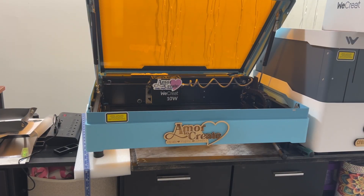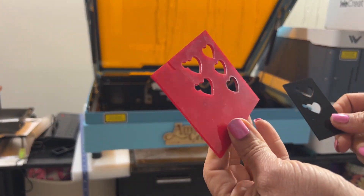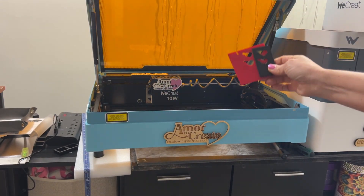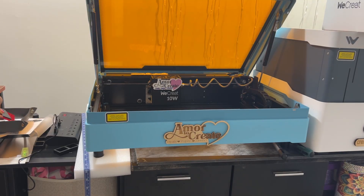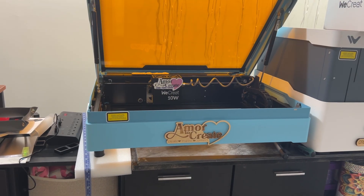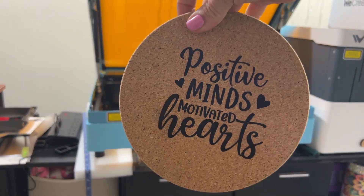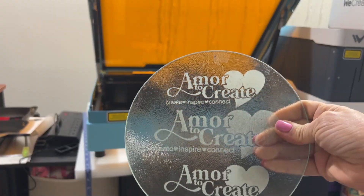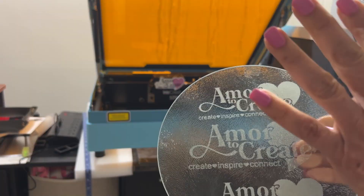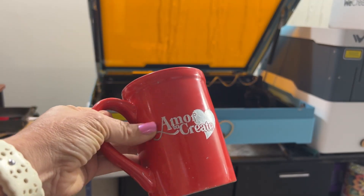As with any other diode laser, it has its limitations when cutting acrylic. You can cut black or red acrylic, but I don't recommend a diode laser if you really want to cut all colors of acrylic, because you won't be able to cut some colors like transparents or mirror acrylic. You are able to cut and engrave wood, engrave items like cork, and engrave glass — though to engrave glass, you'll need some kind of medium for the diode or blue laser to see the glass. As with other lasers, you can engrave on ceramic, but you will also need a medium or paint to do this.